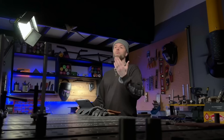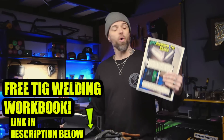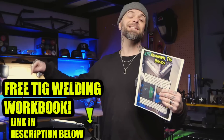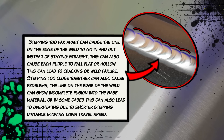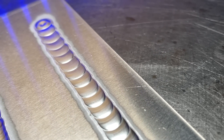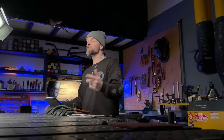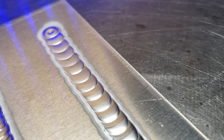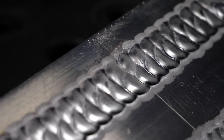What does this mean? Let's pretend this pass is now stretched out into a single lane instead of a weave. Do you see the gaps in between each step? This is something I talk about in my episodes all the time and it has its own section in my TIG welding workbook, which you can download for free — link in the description — on stepping distance. When the puddles get spread too far apart, we lose the line on the edge, and the main problem is that the arc loses more and more focus as bigger steps are taken. This is a space where no filler material is added and where penetration is going to be compromised. With a single pass, I would absolutely never step this far apart, so you can understand why I wouldn't be okay with this much space in a weave.